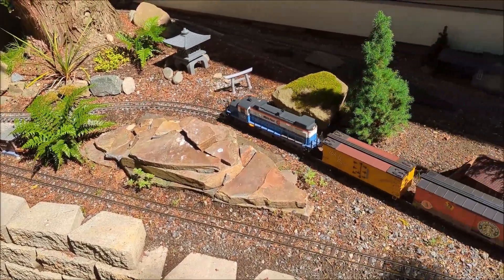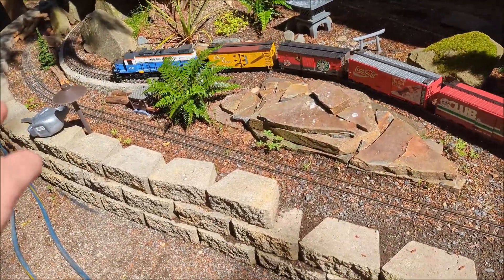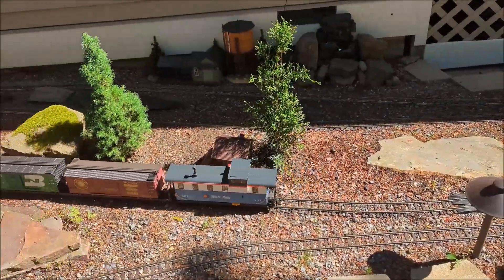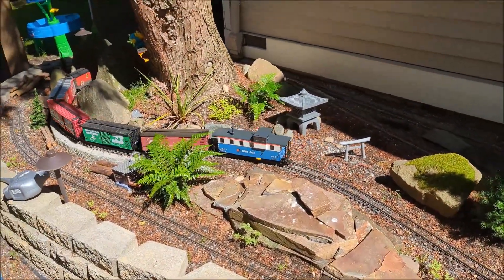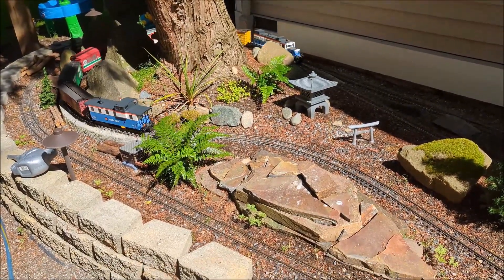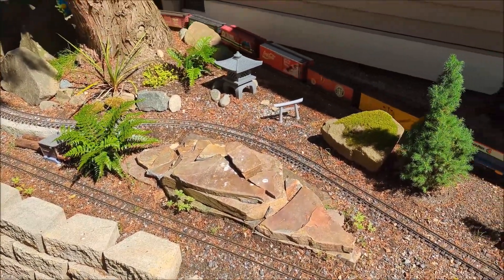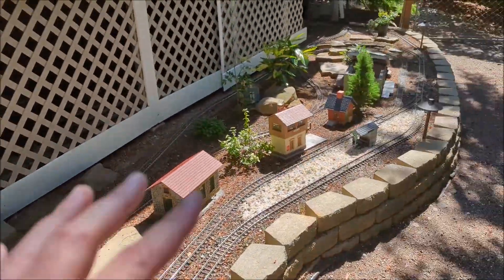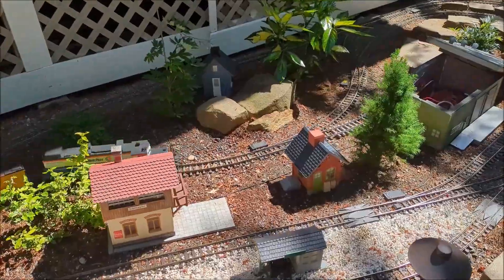That's what I'm trying to use on most of these over here, and the reason is these outdoor lights run off 12 volts — so if I don't have to put in a resistor, all the better. I just plug it in and it runs off the power it should. For most of these I'll be using 12 volts, and honestly if I could do it all over again I probably would just use 12 volts on everything — it's easy and it's not that much of a hassle.